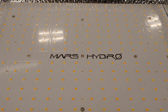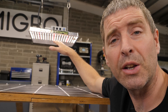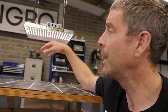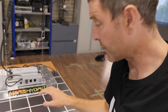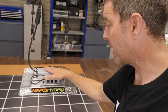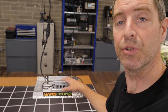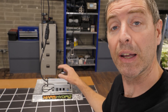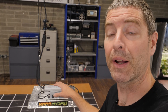The quantum board format uses an LED board with many single LEDs mounted onto it. What this new format did was take those boards — which at the time were sold plainly without sophisticated mounting arrangements — and add a reflector-type design. This aluminium reflector mounts the LED PCB board, with the driver mounted on the back. It's a very economic design that enabled prices to be reduced while still delivering fairly good performance, and it became very popular with many other manufacturers embracing this format at the budget end of the market.